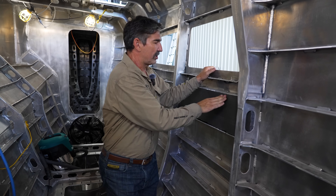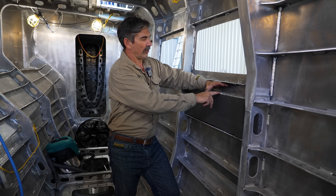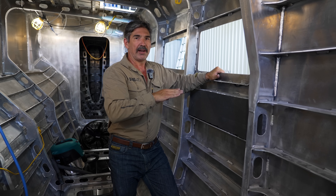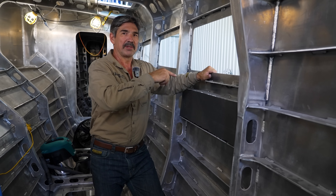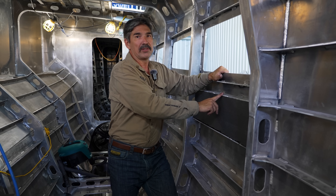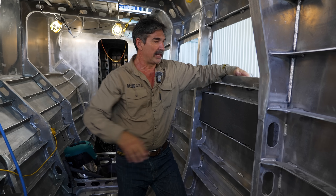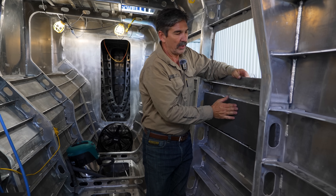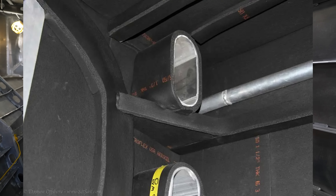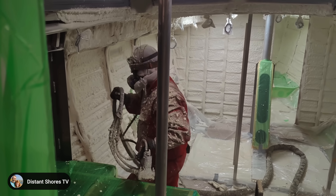The problem is that even if one area is nicely insulated, a little exposed strip of metal will still conduct heat from outside, or if it's warm inside and cold outside, condensation will form right along that strip and start to drip — which is exactly what we want to avoid. One option would be to put the insulation sheets in and then put another sheet on top covering everything, but it's going to be tricky to get into all the grooves and corners — which is actually another pro of spray foam insulation, because it just fills everything.